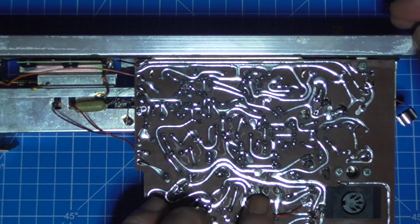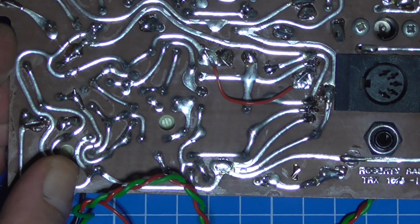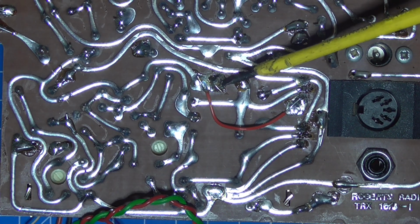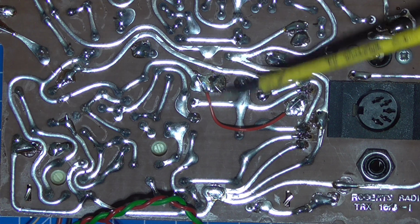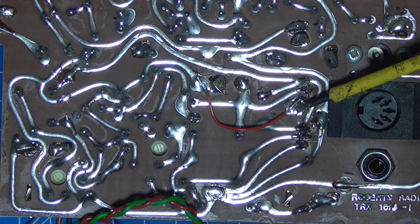Yeah, I can see some soldering work here. I'll zoom you down. If I use a pointing stick, I can see some soldering work here. They've actually left the capacitor leg on, so they've probably broken off the 2 capacitors between. This is one capacitor that goes from here to here, and another one there that goes, this link wire is responsible for the quiescent current.